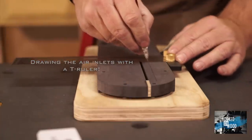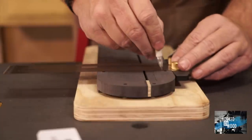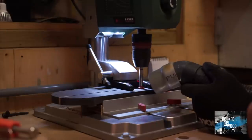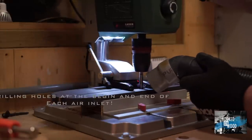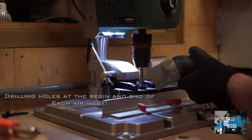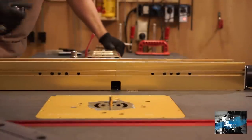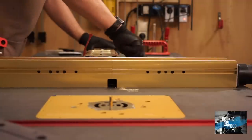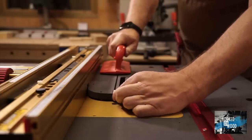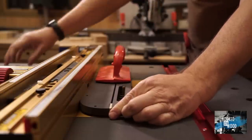We draw the lines for the air inlets. Be sure you do not make the bridge between your saw blade and the air inlet too small — otherwise this piece will start to vibrate when the saw blade is spinning and you lose the benefit of a zero clearance insert. I am drilling holes at the beginning and end of each air inlet, and we later have to connect these holes with a jigsaw or router table. If you do this with your router, be careful that you always move your wood against the spinning direction of your router bit — otherwise it shoots out of your router table.